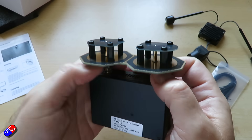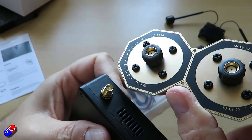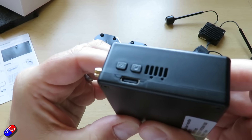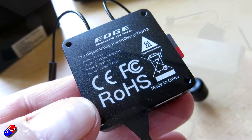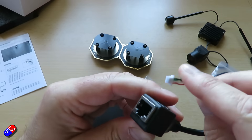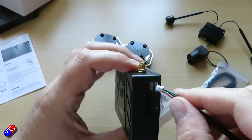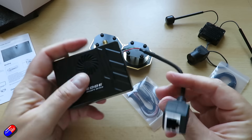I asked my Patreons, when I knew this was on the way, what kind of questions they'd have for a system like this. So here are the quick-fire questions and answers — thank you to the Patreons who replied. In terms of legal compliance, I'm not exactly sure where we're up to. It does have a CE mark on it, however I haven't seen full compliance documentation yet, but they're claiming it is fully compliant. Maximum range is 35 kilometres. Latency is 60 milliseconds. Image quality is 1080p. Electronic image stabilization is not supported — that's one of the few things it doesn't do.